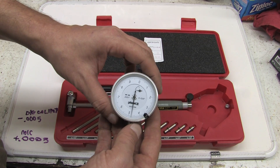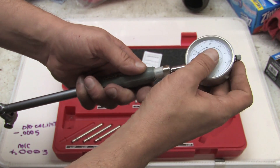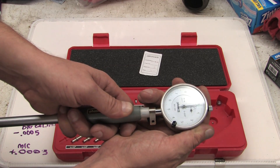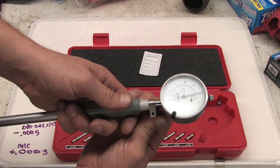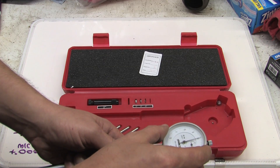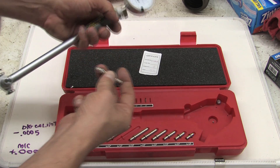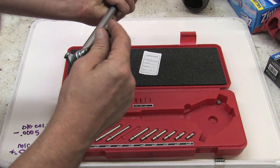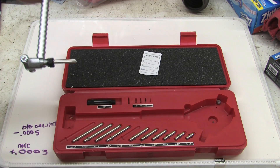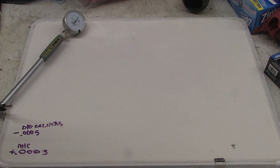In this case, you would need to take your measurement and subtract it from whatever you have set up as the tool width. You put the gauge inside the handle of the bore gauge and press it until the needle pops up to the upright position — that lines up the hundredths mark to make it easier to read. Once you've got it up there, you can rotate the gauge face to set a zero point more accurately. There's the 3.2 inch guide, and I'm going to add the ten hundredths and five hundredths spacers to it, then stick that on the end and lock it down with a collar. Now what we have here is a piece that is supposed to be 3.35 inches.